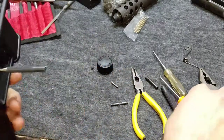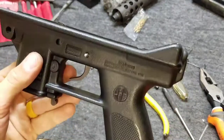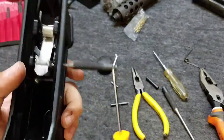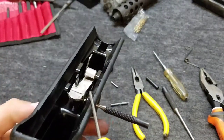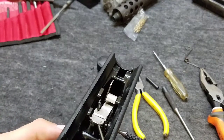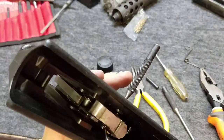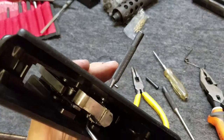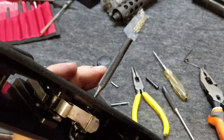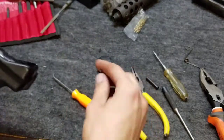try to give you another view of how everything should look. Trigger is still a little bit too far forward because we haven't got everything aligned yet, but I've got it all retained by this pin. And it goes this top hanger section here, the spring, the trigger, and then back through the top section here. And then this pin, disconnector pin and spring are being retained and cannot come out because of that trigger leg is in the groove there.